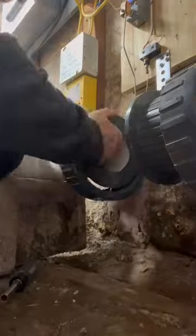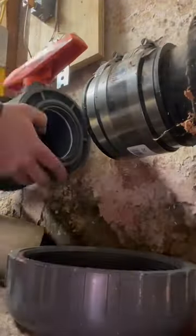It actually triggers two relays. One of them turns on a strobe light in the front of the building to let them know that the pump is still shut off, and the other one shuts off the ejector pumps. It's pretty cool, pretty creative, actually.